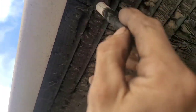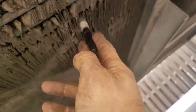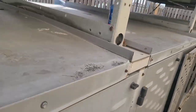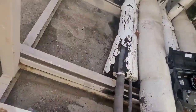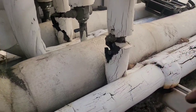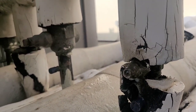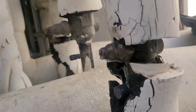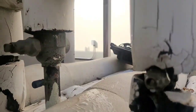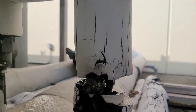As bad as I didn't trust this coil, it appears that it was made with copper — that's a reasonably thick wall — so I don't think it's leaking. Come back over here, we'll grab this highlight right here and see if we can confirm a leak. It is a very slow leak — see, we got a bubble growing in there. This is, of course, with the pressure down because it's off. But it is a leak.